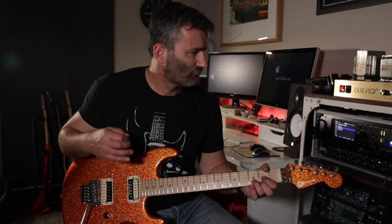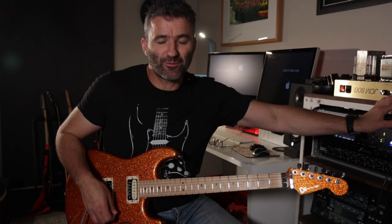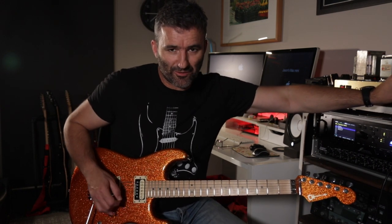All right, well, I'm back on the gain channel. Here's our stock sound. And I'm going to bring in the first clipping mode. So this is the 20 volt Zener clipping, and it'll bring the overall volume down of the amp, so I'll just bring the master up accordingly.